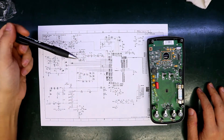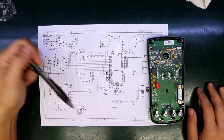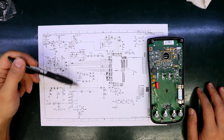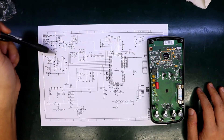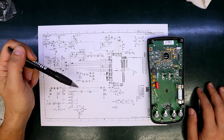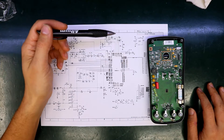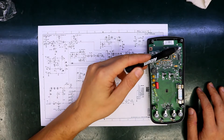Here is the unit and this is the schematics of this meter. As you can see, the entire unit has been designed on a single chip solution. This is the typical Fluke input circuit and the cold compensation network. Here is the precision resistor network divider. I did some tests already and I found that there is no frequency of any oscillation here across the crystal oscillator.